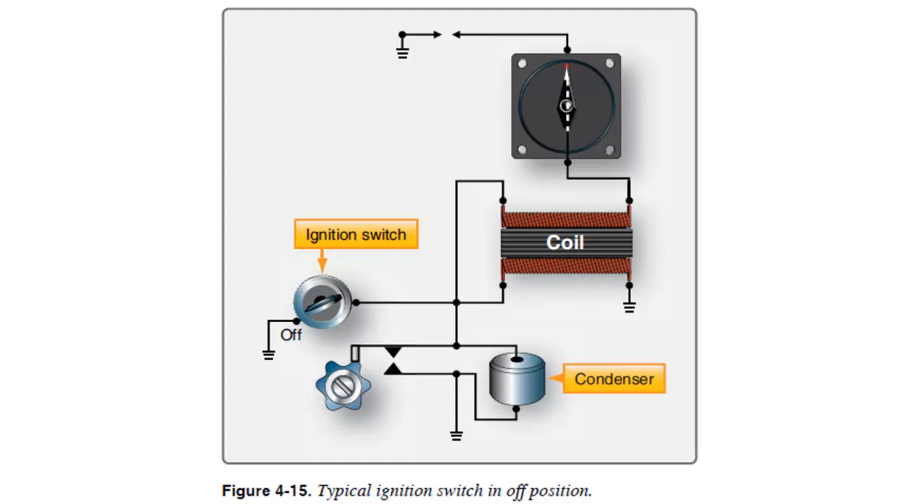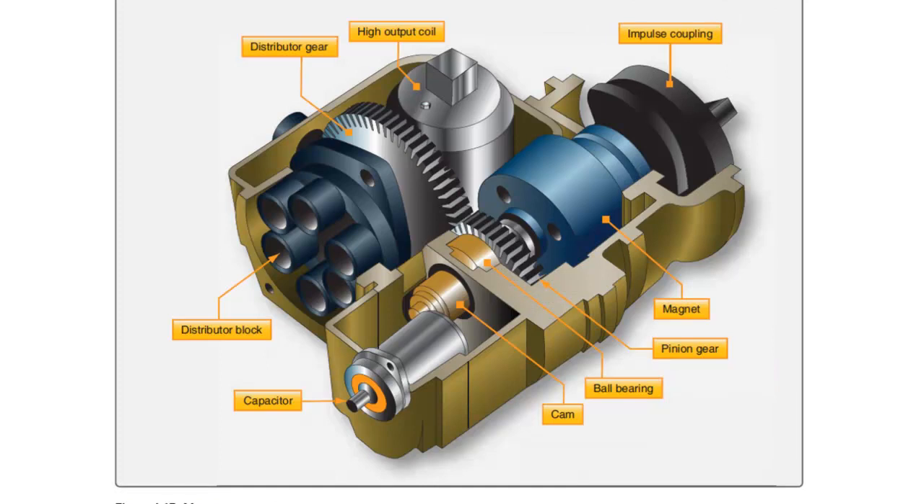These work by default — another way of saying that is they are fail-safe. Here is a more detailed diagram of the magneto. We have the drive over here at the impulse coupling — we'll talk more about impulse couplings in a minute. The impulse coupling engages a slot on the inside of the engine that is turning, so this whole thing gets turned in proportion to engine speed. We also have a set of gears that run the cam for opening up the breaker points, and we have that driving a distributor to distribute the spark to the various cylinders. I recommend that you follow the link in D2L to the virtual magneto and go through the steps of assembling each of those parts — that will give you a good idea about how these things are put together.